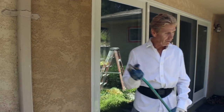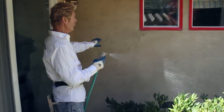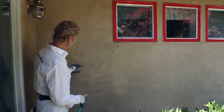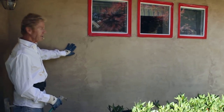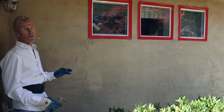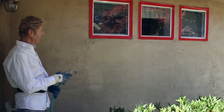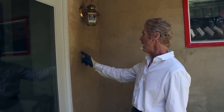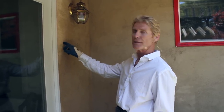So I'll show you over here, because we're actually doing a wall. This work here was done, but when the guys did this, they just troweled it on — which is not bad — but they didn't know they had to do a float finish. We've got to match this finish here. This is heavy sand. That's been floated to bring out the aggregate and the texture.